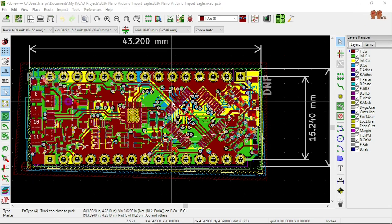I'm kind of fed up with this, and I think I'm gonna be doing this differently. The components I'm gonna be using are gonna be 0805s, not 0402s. One because they're too small, the other because if I increase this by 2 millimeters, it's not gonna be a big difference, right?